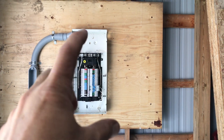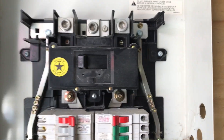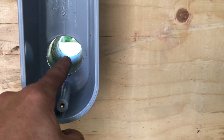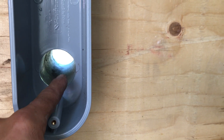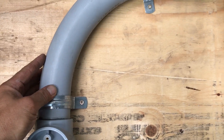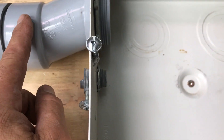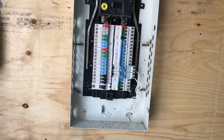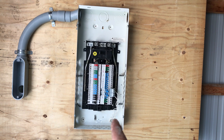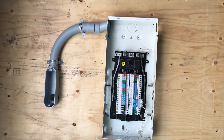Because it's a garage, I established the panel height which is at eye level right here. I came in with an LB and measured the pipe from that male adapter to the LB — it was eight inches. I glued that together, then a manufactured two-inch elbow which I glued in, and left that piece somewhat loose so I could glue it in while supporting the panel with one hand. That was my final glue right there. I fired a screw in, then put on all four bracket screws.